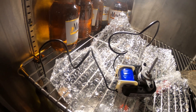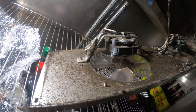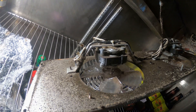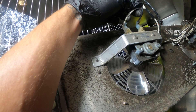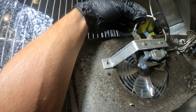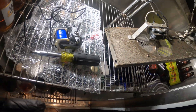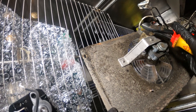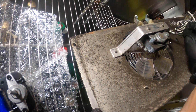Here I have a brand new fan motor — simple 120-volt single-phase, two wires. Let's start clearing some of this up and free up these wires. We have a black and a white wire — black is going to be our hot line, white is going to be our neutral. It's just two connections. These will need to be wire-nutted, so go ahead and cut those.